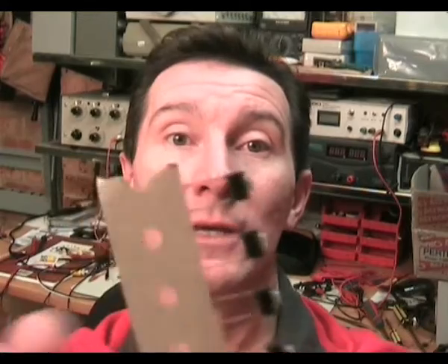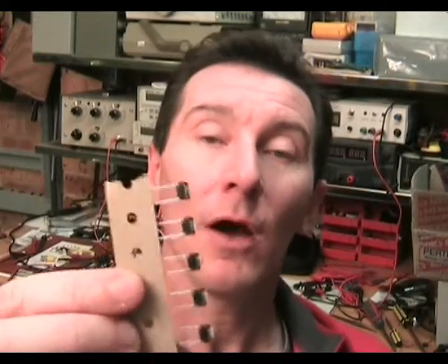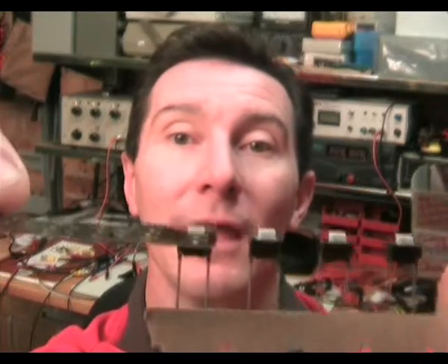Because the keys only had a very limited height on the actual key switch, I had to make the overlay as thin as possible. So I used a 0.5mm PCB — it's really thin — and that just slips straight over there like that, and you can still push the button through, and that's what it turned out like.